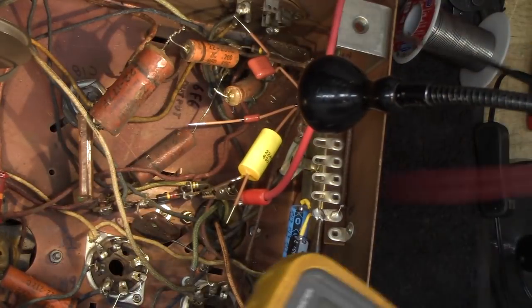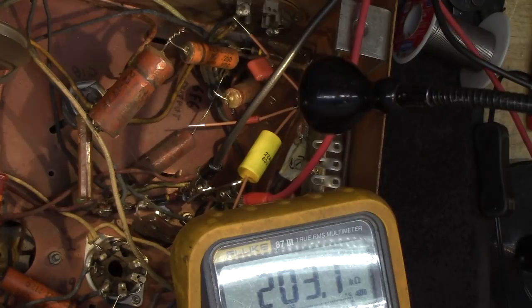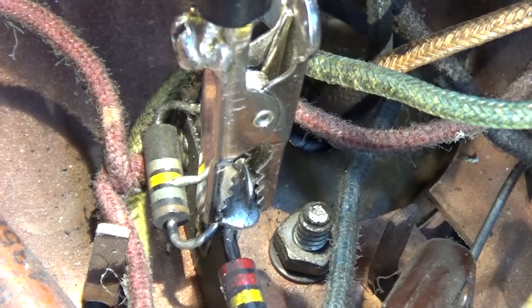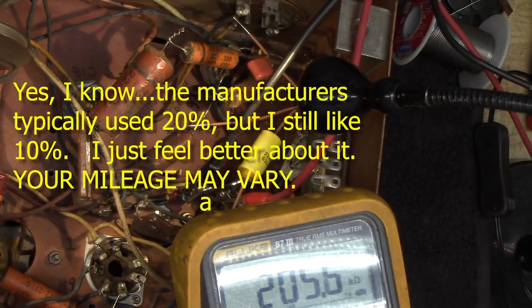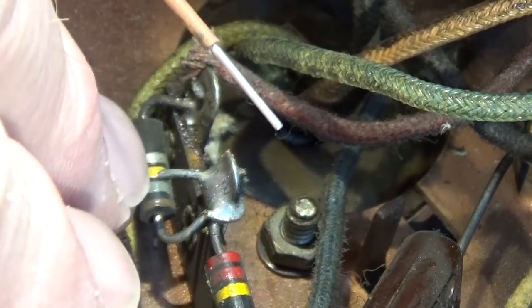Let me put the multimeter where you can see it. Let's connect it up. Looks like 204, 205 kiloohms or so — looks kind of like a capacitor might be charging up. 205 kilohms, which is pretty high. We're talking 25K higher than the resistor is supposed to be. 180K is the rated value, and 10% of 180K would be 18K higher — this is greater than that. So to me, that says get rid of it. Now if it was right at 10%, I might get rid of it too; it's just going to be a judgment call. But for me, 10% is that absolute drop-dead threshold. If it's out by 10% on the high side or more, it goes. So I'm going to remove this guy and put a new one in there.